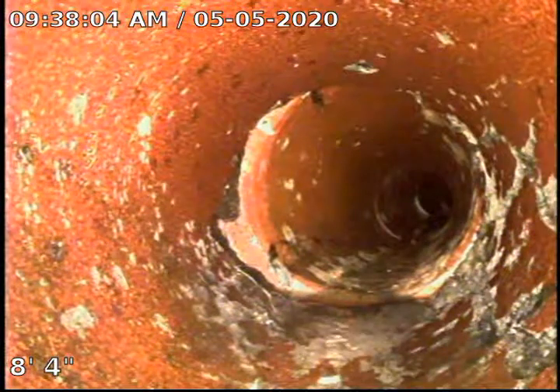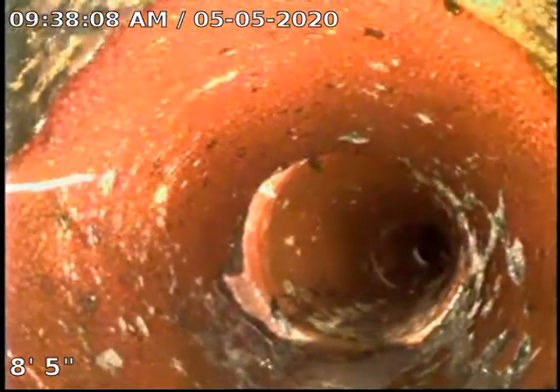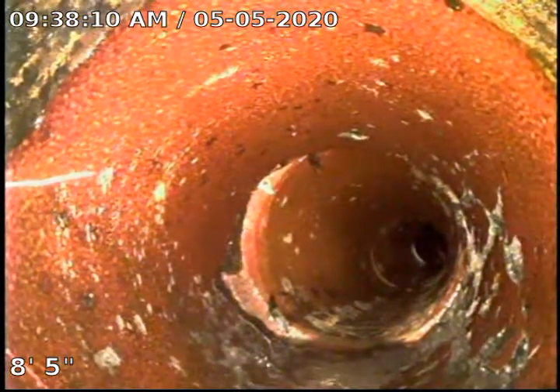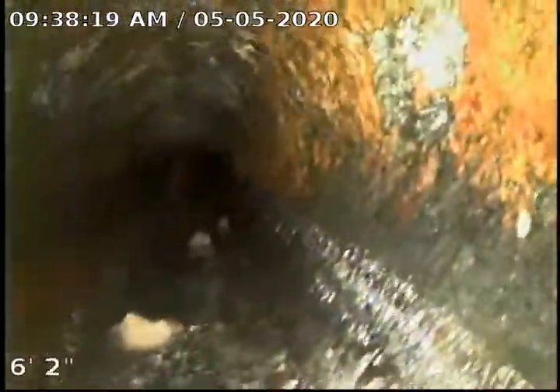We have located this area. It's up in the landscaping, about halfway up. The sewer basically runs just about under the tree at a bit of an angle. This is the 4-inch cast iron building drain, and here's where we tie into the storm. We're coming up through the main sanitary clean-out. We're at the main sanitary clean-out.